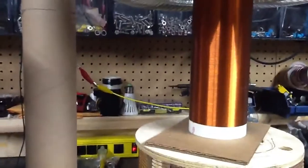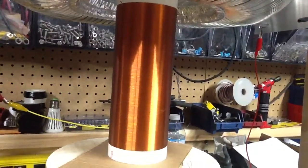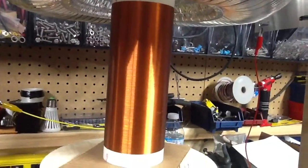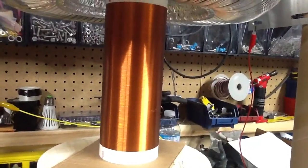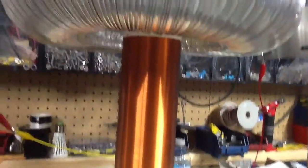It's pretty cool. It's close, I guess, two and a half times the diameter on the resonator is what the length is. A lot of Tesla magnifying transmitter builder guys have noticed that not necessarily equal diameter and equal height is optimal — up to two and a half times the resonator diameter is pretty close to optimal.